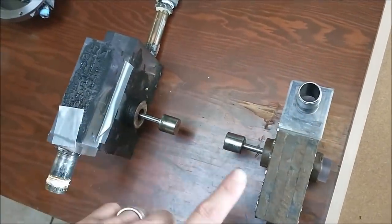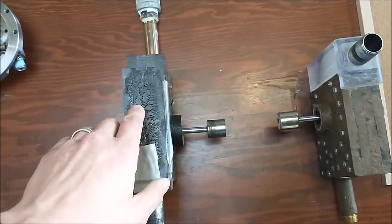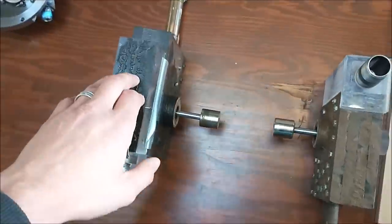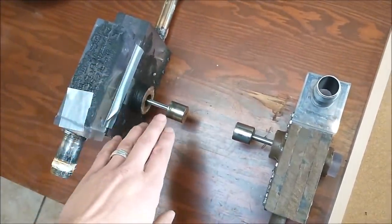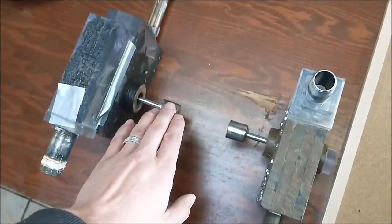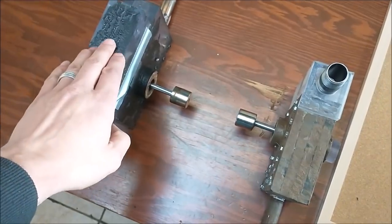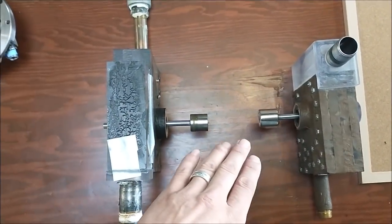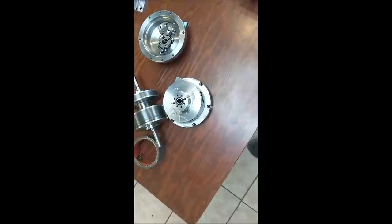In the last testing that we did, we had a pressure and temperature differential that would increase when the turbine got up to speed. We should see an even greater pressure and temperature differential with two turbines compounded together.